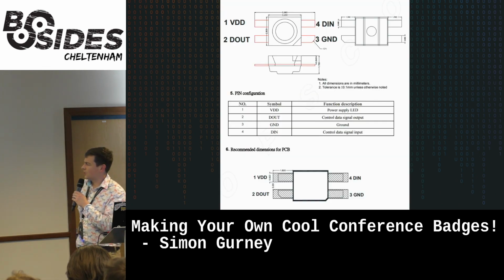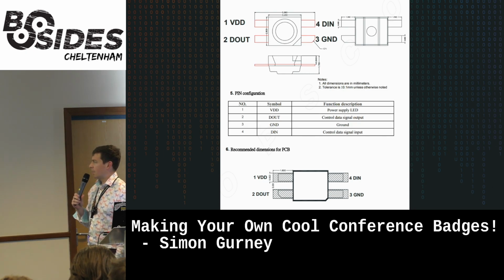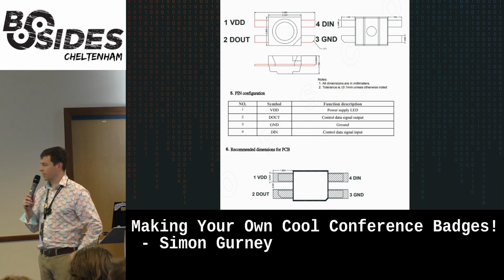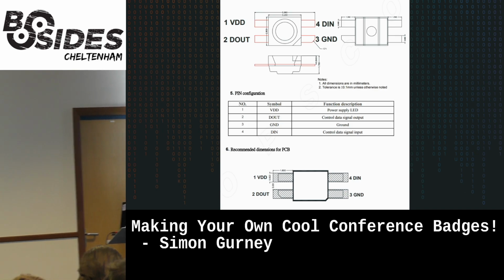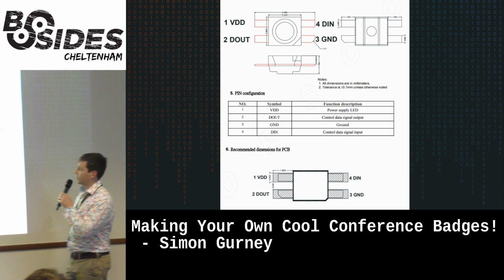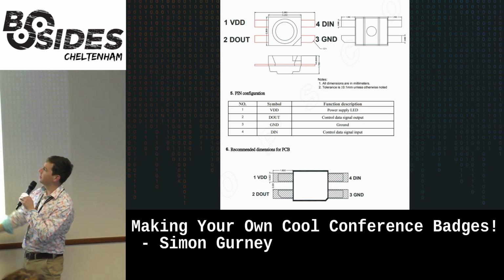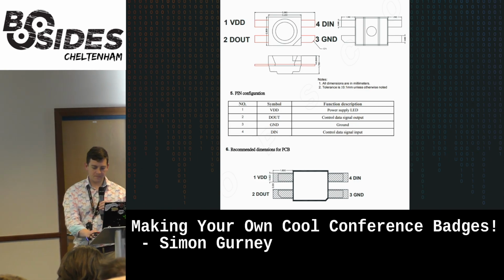Okay, so this is a data sheet. If you're buying from a reputable place like DigiKey, everything's going to have a data sheet, whether it's the controller or the LEDs or whatever you're getting. And they will have in the data sheet stuff like this, which is exactly how to lay it out on a PCB. So this is a footprint we'll use to create it. Some of the measurements are at the top, annoyingly, and some are down here. So that's what we'll use to create the footprint.